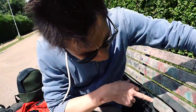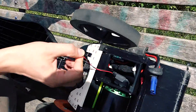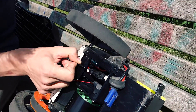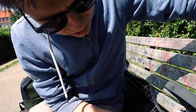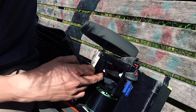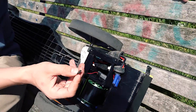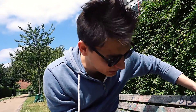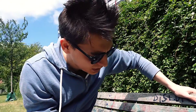This movement could be caused by a drill hole that was too big, or it was just not screwed in properly. Because of that movement, the cables were positioned somewhere here, flexing against the capacitor. My impression was that the connector broke off because of that flexing — and that turned out to be true. We're just super lucky we didn't have any short circuits, because this is a 3V and ground line.